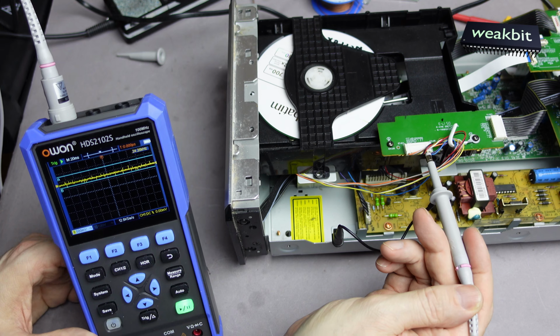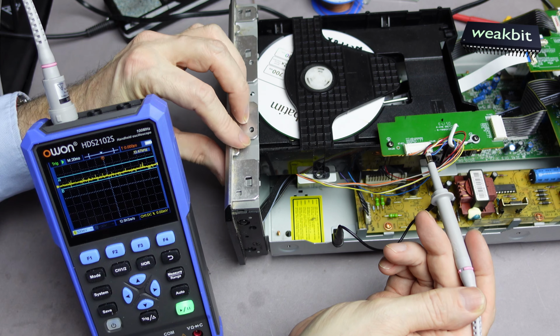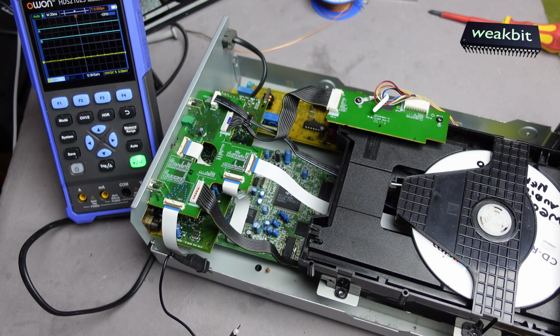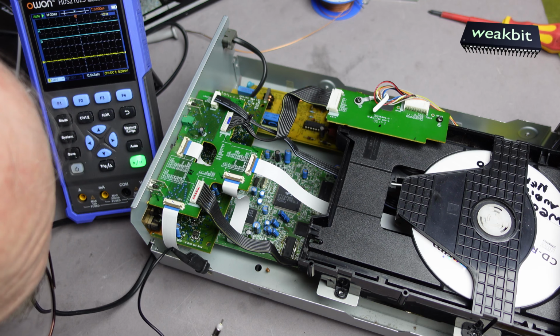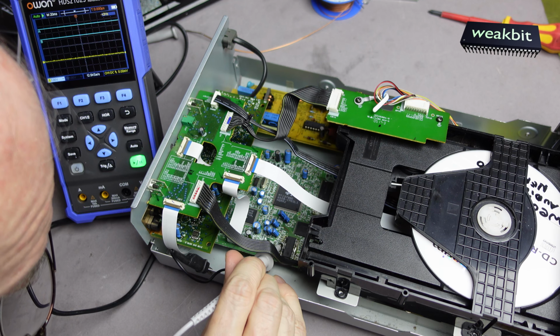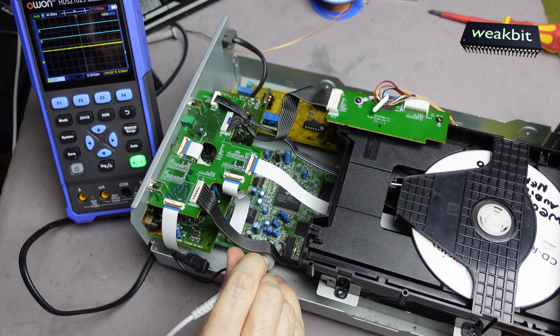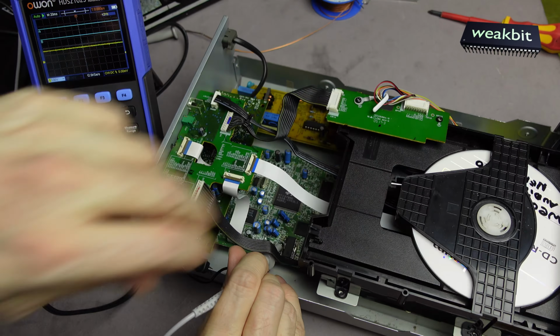It's not going down to the low voltage. On here on the oscilloscope, you see it. It's going down. Pin number 6 will enable the motor to spin on this motor driver BA5954. Is it 5954? Yeah, 5954. Pin number 6 will start to spin. 2, 4, 5, 6. Okay, on 6. And now we must open and close it. And now?